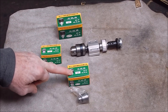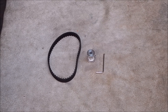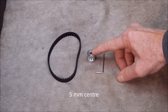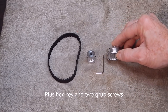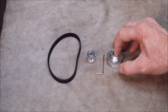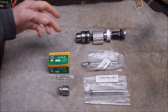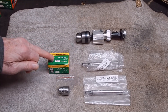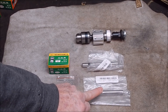The Jacobs taper sizes are JT3, JT2, JT1, and little baby JT0. An additional package you can get is a 16mm gilmer drive pulley for the electric motor — also optional — which matches your 32mm spindle pulley, giving you effectively a two-to-one motor ratio. You also get a little belt. You can separately purchase a JT1 spindle and a JT0 spindle to suit the 6mm chuck and the 4mm chuck respectively, each with a 10mm spindle size.